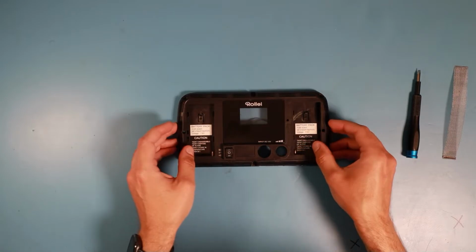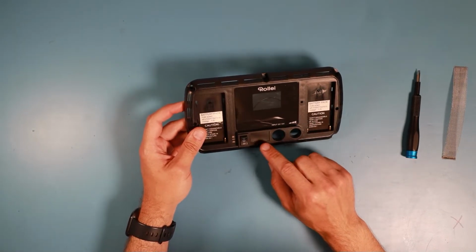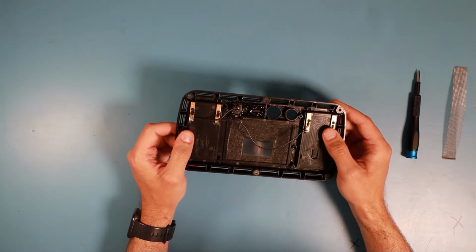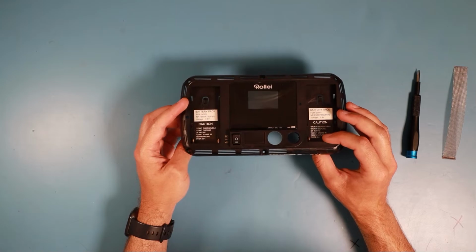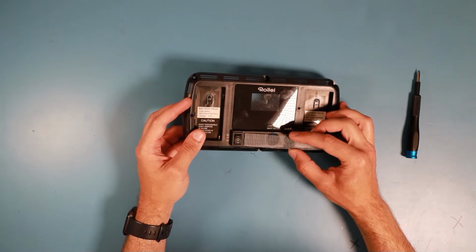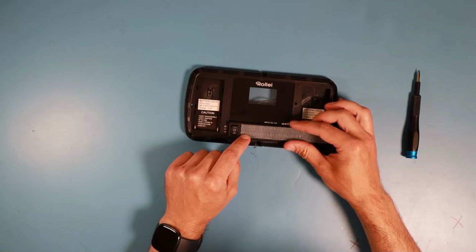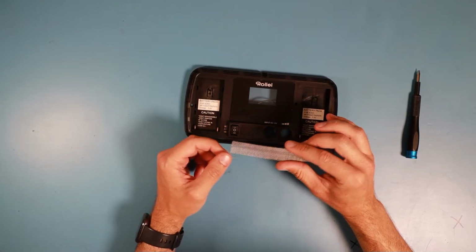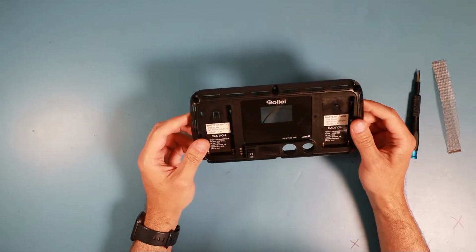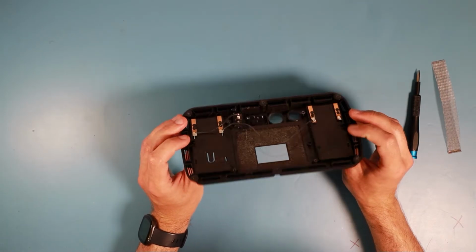So, like I showed you before, this case has a spot where an unused component could be placed, and this spot is prepared inside of the molding of this case, but has been glued shut after that because it was not used. And I want to reopen this and glue this metal mesh, which is stolen from a broken smoke detector, in place around here so that the hot air can go through, but nothing falls inside of the case, or no one can touch components inside there, because it's a low power device, but it's still an electrical appliance, so we want it to be at least a little bit safe.